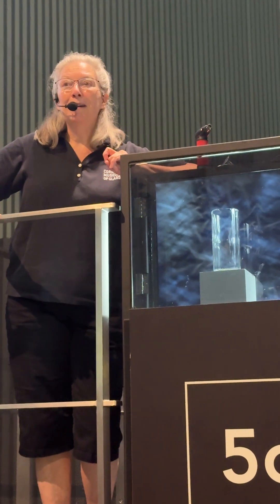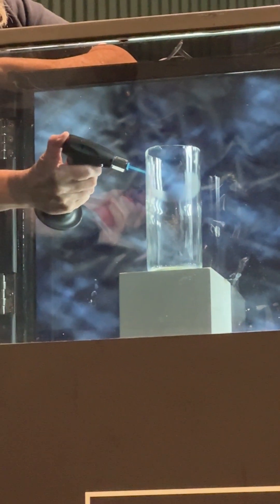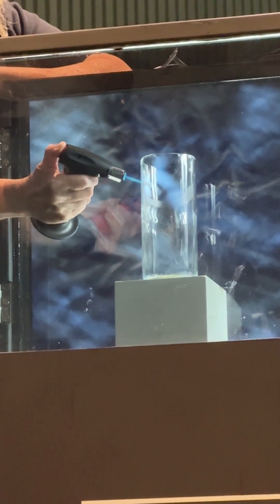We'd sort of like to see what that stress looks like though. We've got it in a polariscope — let's go ahead and stress this glass again. You will start to see that little black and white pattern showing up — that's a small spot of temporary stress. Normally it just fades as it cools, but that piece had a little crack in it already, and so it released the stress by breaking the glass.